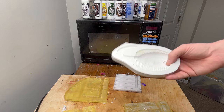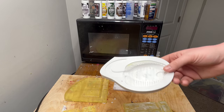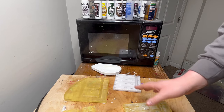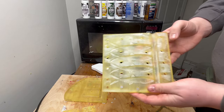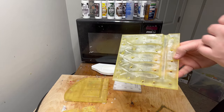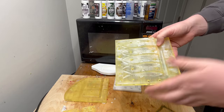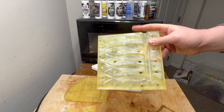The last cost-saving situation is with open pour molds — usually you're going to want more than one. To buy an aluminum mold at that expensive price for just one mold isn't really worth it; you'd need to buy at least two or three. The other major benefit of 3D printing your own fishing lure molds is being able to make whatever you want. I took a picture of a bay anchovy — a very popular bait fish where I live — modeled out a physical lure, and made my own custom bait from an idea in my head to a physical lure I can catch fish with. If I had someone CNC this out of aluminum it would cost $800 for one mold.